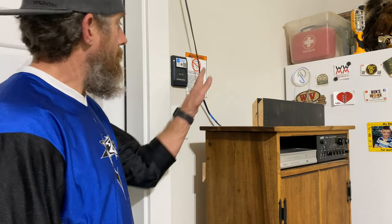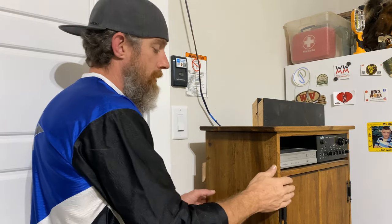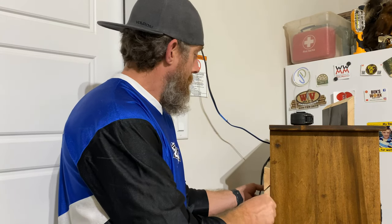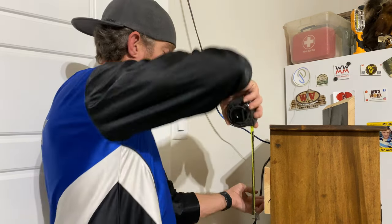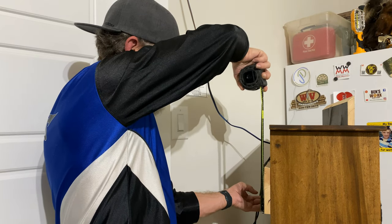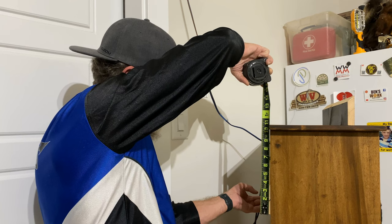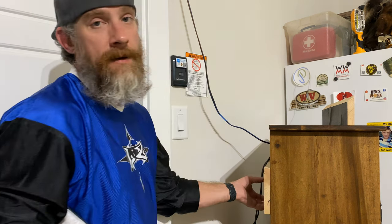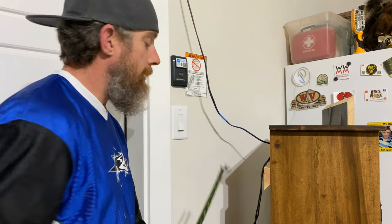The next project today is I'd like to hang my entertainment cabinet right here in this corner. I'm going to roll this around — I cut the first cleat to the size I need. Same way we did it last time, we're going to line it up to the edge and measure from the bottom to where that is — looks like ten and a quarter inches. So I need to go ten and a quarter down, then from there make my mark at ten and a quarter. That's where the bottom of my French cleat needs to go.